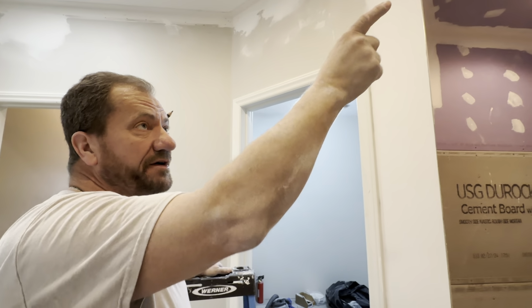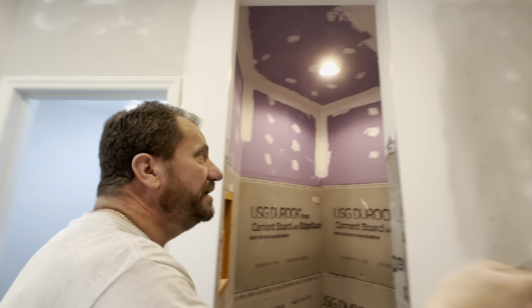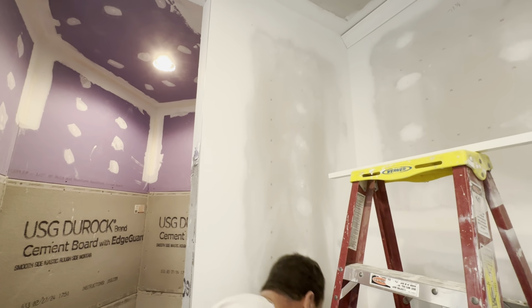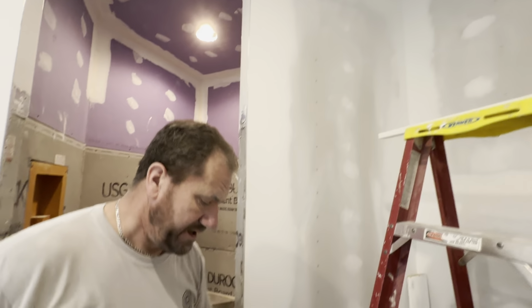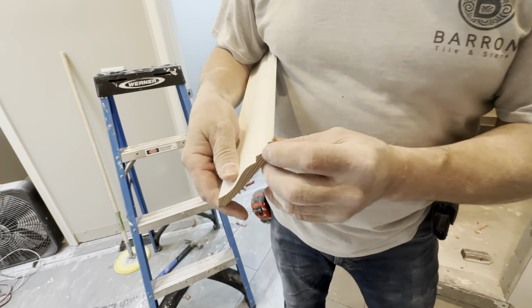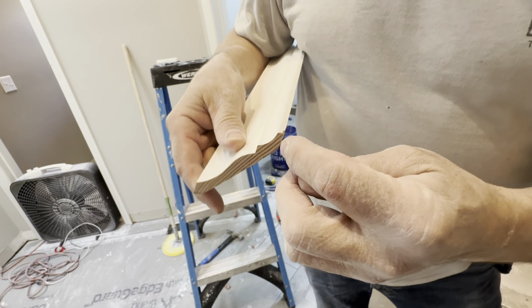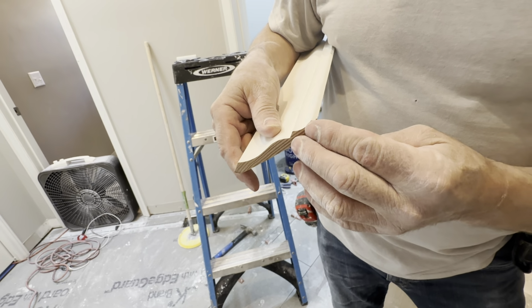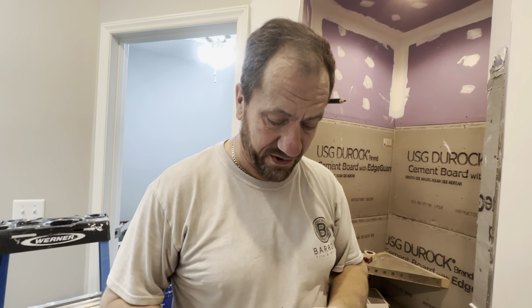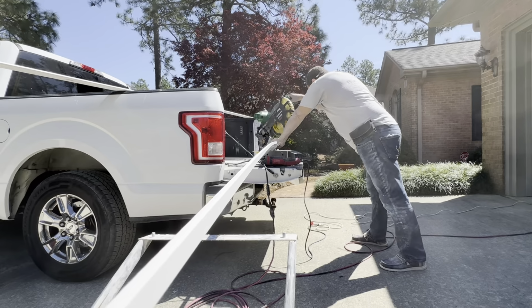So we're gonna grab a measurement off of here. Again, I will measure from the sheetrock right below this. Okay, when I cut off, I need to show that to the outside. When you cut off the measurement and it's angled back, when you cope it, you lose that much length. And that much length is what you need to place over the other piece. It's science, it's math. I don't know how it works, but it works.